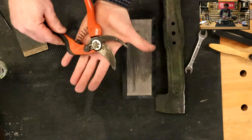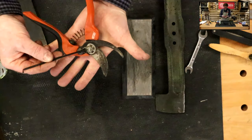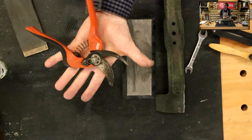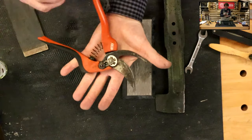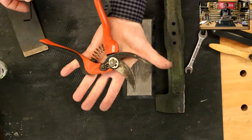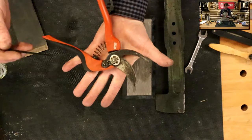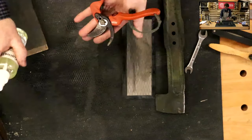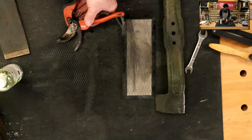Bit weird on here now. If I bring this up, a lot harder to take apart. Yes, they have a lock nut, but they also have this funny spring washer on the back. Very difficult to take off. So don't want to try and take that apart unless I have to. Makes it more aggravated to get it apart, get back together. You're likely to break something. As you can see, really gunky and dirty. So a little bit of the camellia oil will work nicely on there.